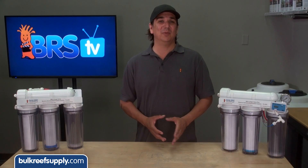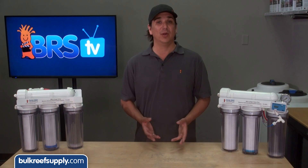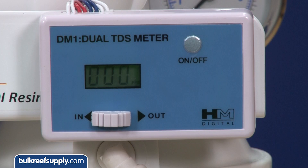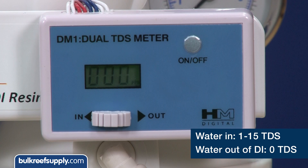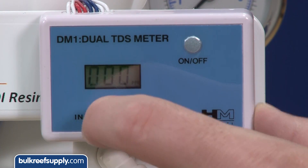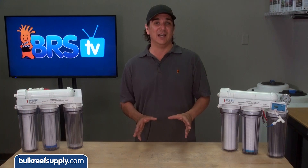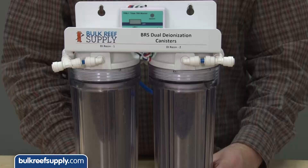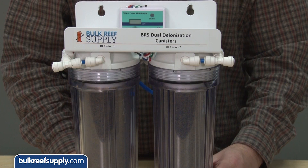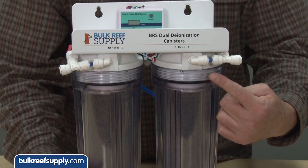Installed like this, you are going to be able to measure the TDS or water quality coming out of your RO membrane, which should likely be somewhere between 1 and 15 depending on your city's water quality. Coming out of the DI it should always be zero TDS. There is a little switch on the front to switch back and forth between probes. On the universal system which has a double DI, the install will be basically the same except it has three probes. You are going to install one on the end of the first DI, one in between both of them, and one on the end.